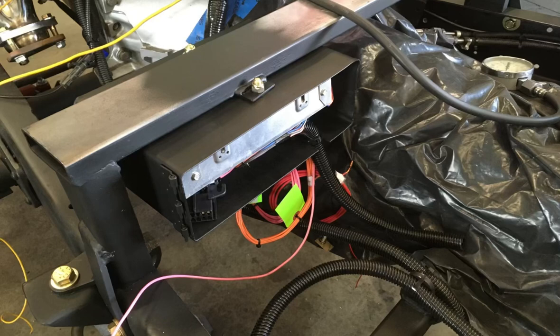On the other hand, say you are running a cooling fan that draws 30 amps, your switch is rated for 15 amps, use your switch to engage a relay that is rated for 40 amps. So your relay will be able to control the amperage going to the fan instead of all that power going through a switch that isn't rated. That's kind of where I stand on relays, and you'll see how few of them I actually use. Remember, I put the engine harness in an ammo box on the chassis.